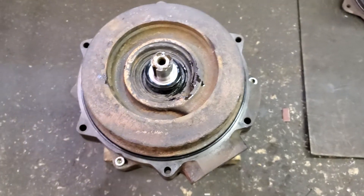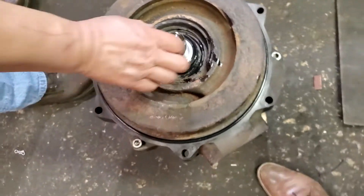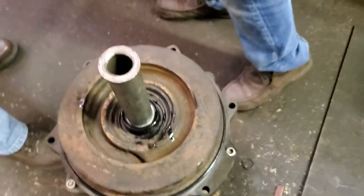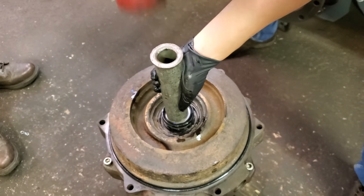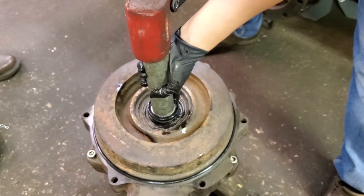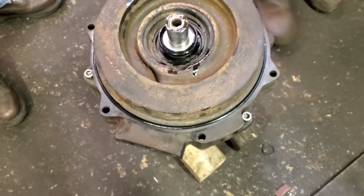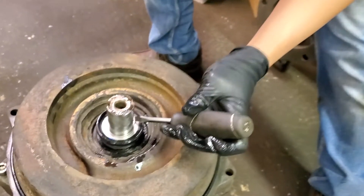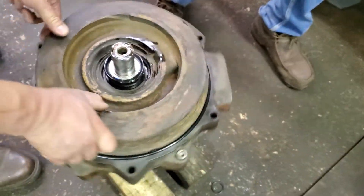We have a pipe to hold over the shaft to push in the seal, and a rubber hammer — just hit it a little bit. They go in there. A piece of pipe over the shaft and the rubber hammer — just a little bit. That's it. See, it goes in there. And we want to make sure the clip is in there, so we use a screwdriver to make sure it turns. That's it — lower seal installation complete.